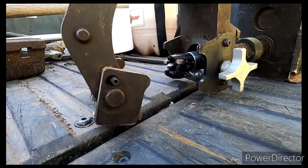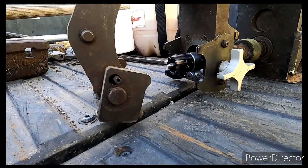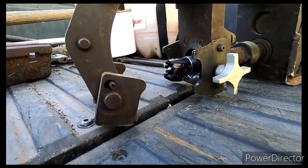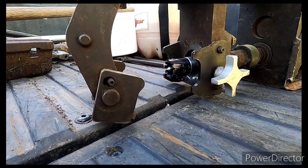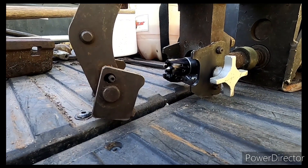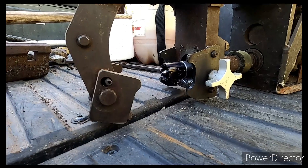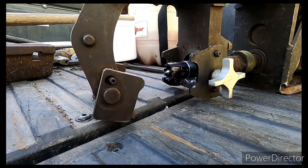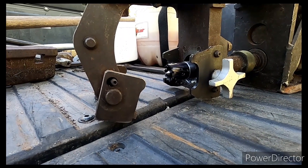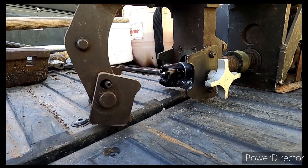The nice thing about this drill — it's a hole bit, kind of like for wood but this is for metal. It's got a spring-loaded pilot. That's what triggers the cutting fluid, and then it just drills the outside of the hole. So this thing drills pretty quick — less than a minute per hole. You're only drilling the outside, and then that spring-loaded plunger punches the plug out. There are a few other manufacturers — Stanley, for instance — they seem to drill the whole hole out, which causes heat in the rail. You can have bolt hole breaks, it takes longer, and uses more cutting fluid.